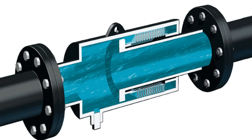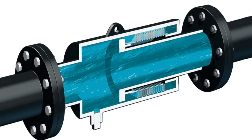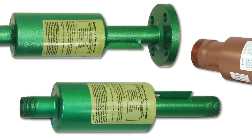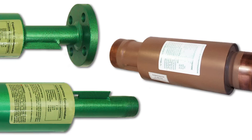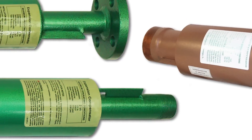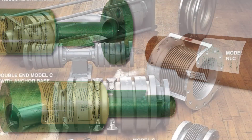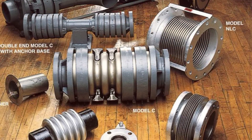Because the housing allows the system's fluid to pressurize the bellows from the outside, it is more stable and can be made longer to allow considerably more compression. Compensators is a term often used to describe a smaller joint, usually under four inches diameter, that also takes advantage of the externally pressurized concept. Compensators are available with threaded, weld, or flanged ends, and sweat ends are available for copper piping systems. So quite a few different considerations and options are available with metal expansion joints.